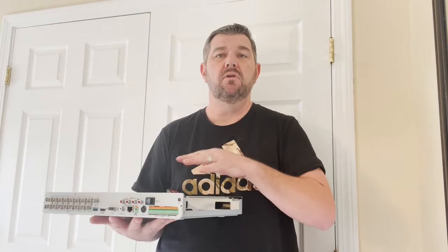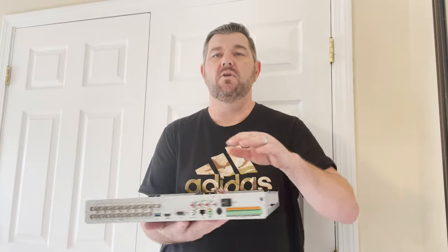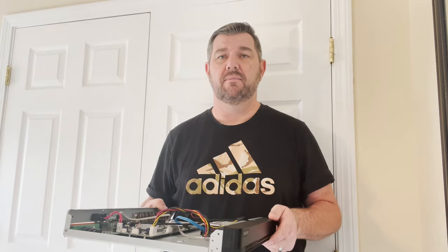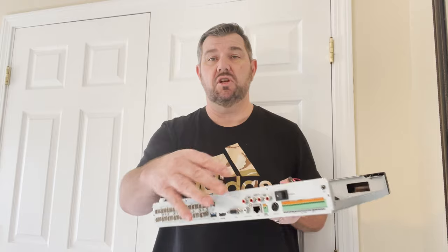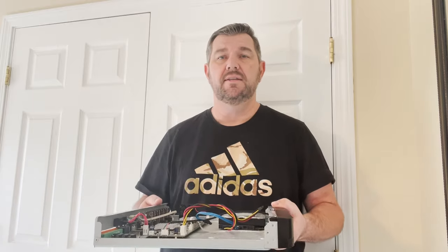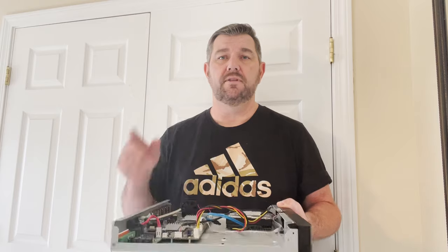Every unit is going to be different — whether it's HikVision, Dahua, Denali, Bosch, Honeywell, whoever you have for a recorder. You're going to have to take it out, look at the number, go to the store and get that number for it to work. They come in packages of two — it's like seven bucks. It's good maintenance on your machine — you don't want to wait till your timestamp's off to replace these. Make sure the unit is unplugged and shut off before you mess with the board. Once you're done, put the cover back on, tighten everything back up, and you'll be good to go for another few years. Hopefully the video was useful — we'll see you in the field.